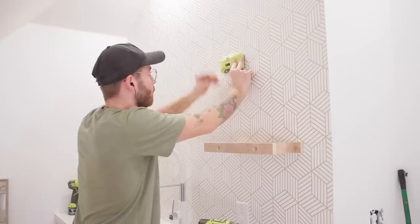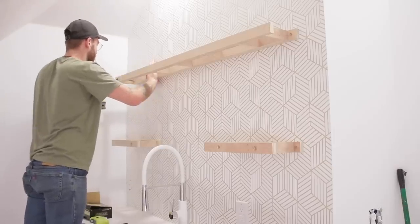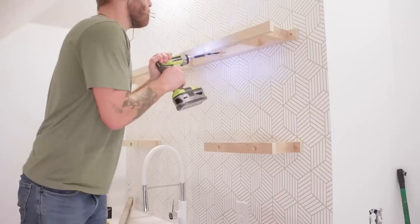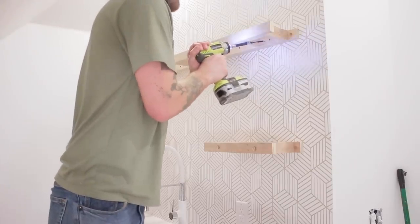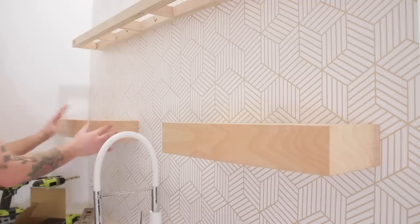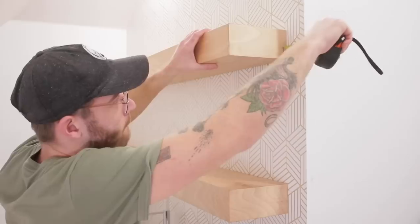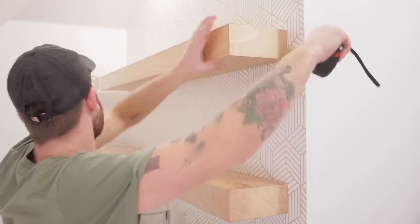I really don't think these floating shelves are going to be carrying that much weight, but I always lean towards adding more screws rather than not enough — so I tied into quite a few of the 2x4s behind the wall and the bracket was really, really sturdy. After that, you can see how I could install the rest of the floating shelves basically as slip covers over these brackets. I made sure the frame on the inside had about an inch of wiggle room left and right so the shelves had plenty of adjustability to line everything up the way I wanted.